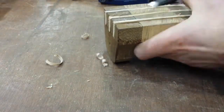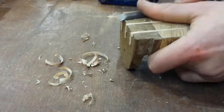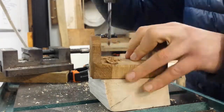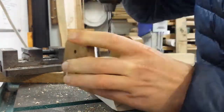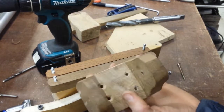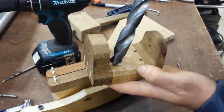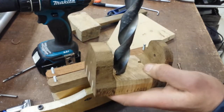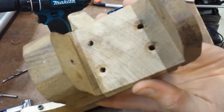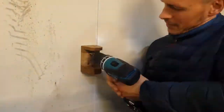Let's go back to the wall mounting bracket — just trim off where we put those splines on. I used the chisel on that side, but then for the end grains of the splines I got lazy and took it over to the disc sander. And then we're just going to need some mounting holes to screw it onto the wall — I'm going for four of those. So we're nearly ready to mount it up. This is what happens when you can't find your countersinking bit — I know it's ridiculous but it actually does a reasonable job. Let's mount this bad boy already.